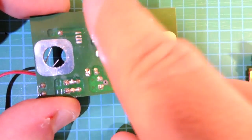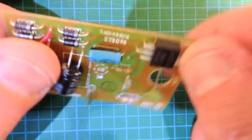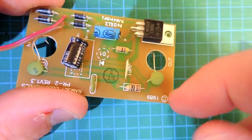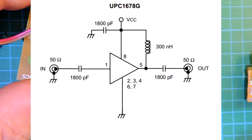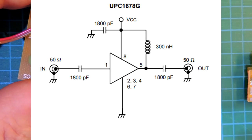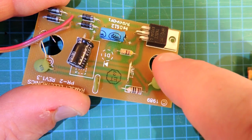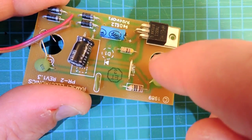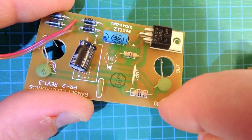So this is the original board and I've taken off the IC — it's just a SOIC 8. I'll throw away the rest of this assembly because it's just not going to work for a near field probe; these capacitors are simply too long. Looking at the data sheet, the circuit is really simple — just the amplifier and three passives. What I really need to do is make the signal paths very very short and get rid of any loop to avoid antenna effects. This is also an inductance which is not appropriate for an amplifier.